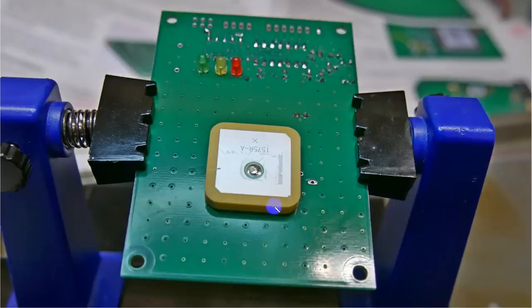This is the patch antenna. This whole area right here underneath it is a solid copper ground plane underneath the paint on the board. Okay, and this right here connects through to the other side to that receiver. And Hans suggests that you put these LEDs on this side because this side will be facing up or toward your window or whatever works.